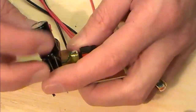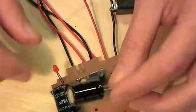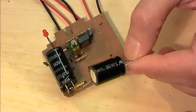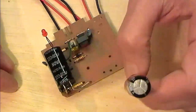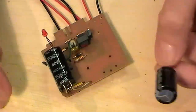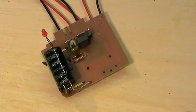Now you can effectively stack these, pos to neg to pos, and stack them up to increase the volume. The cap actually stores the voltage. All you're doing is releasing all of that voltage that's stored in there in one short burst to cause the spark. And again, you can double these up. Best one is 220 microfarad at around 300 volts. If you can't get that, mine, as I say, has come with a bad one. But I'm going to solder these two wires on, and then we'll start adding a battery and seeing where we're going. I'll be back after this in 2.